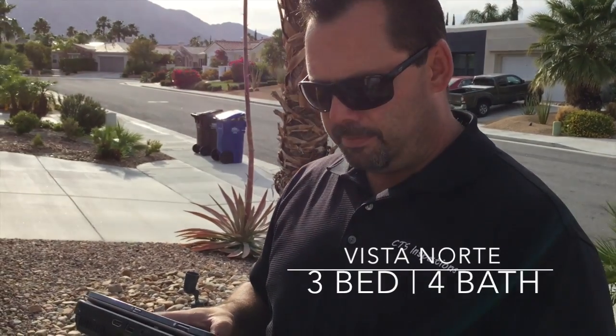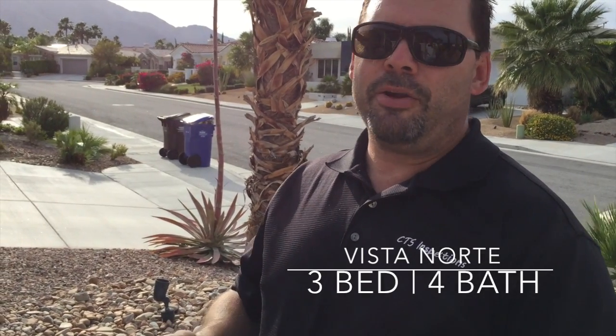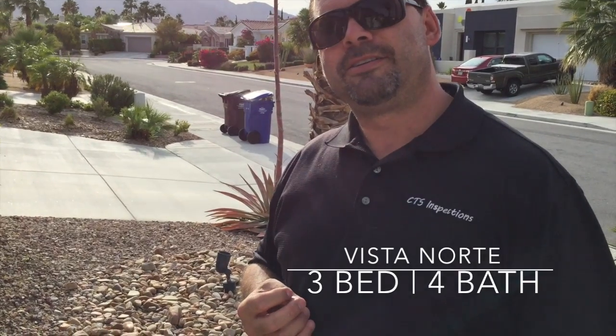And how do you repair those? Well, they're a clean break, so a roofer might just put them together and seal it with some roof sealant, or just replace them with another tile. If they don't get replaced or sealed, the cracked tile is going to allow water intrusion underneath the tiles, and then it'll get into the underlayment and work its way through. So it's likely fine, but it's best if it's actually repaired? Absolutely. Okay, I can go with that. Where are we off to next?